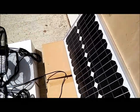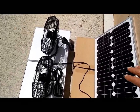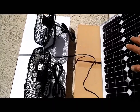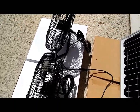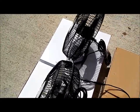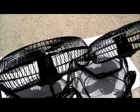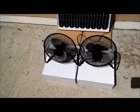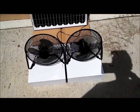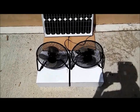This being a solar-powered system running without the battery, I'm going to quickly cover the panel just to show you the impact of shading. I don't know if you can hear that they're slowing down, but they actually are. Eventually we'll get them to stop if I get enough shade here. I got my arm all the way across the panel and they're still going — I think that amply demonstrates the drawbacks, but also the benefits of running directly off of a panel.